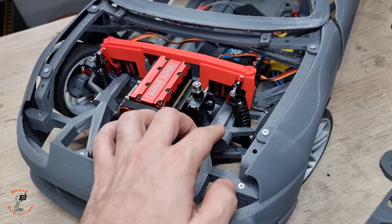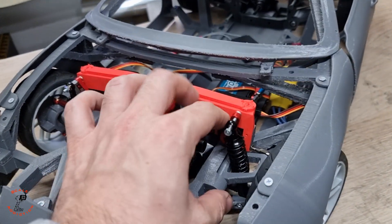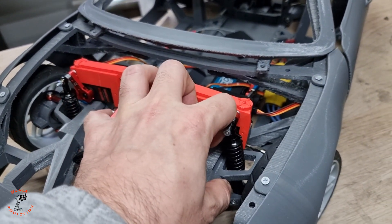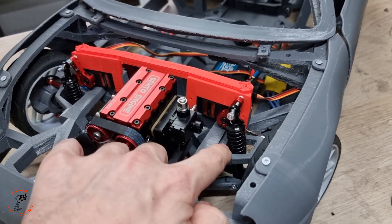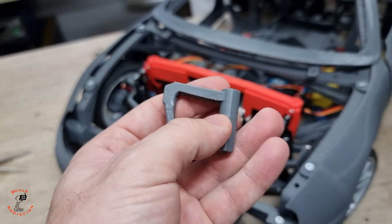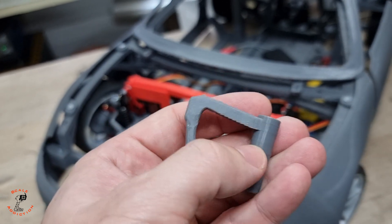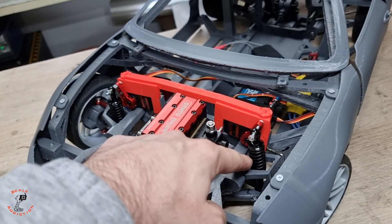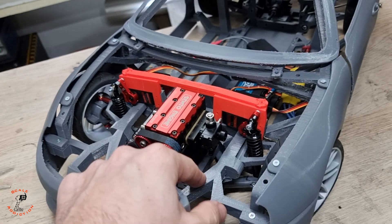I thought I'm not gonna drive like this because right now it's too low, but when you drive it the servo will push it down and you won't hear anything. However, it was annoying that the spring was hitting the arm, so I redesigned it — I cut the sharp corners so now it's round and the spring won't hit it anymore. I will fit them once I 3D print the new chassis.